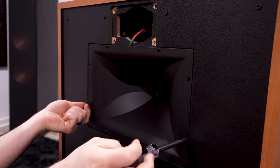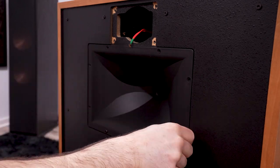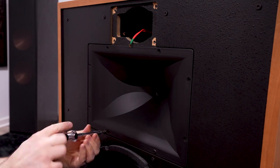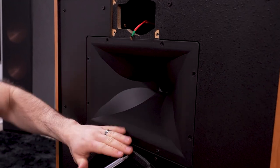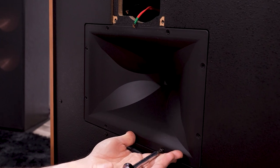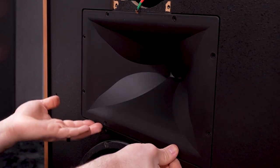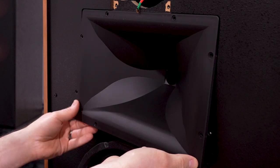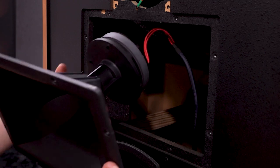Another thing I always mention on these drive components: you're going to want to save a bottom screw for last, especially if they've been removed before and don't have that paint seal. The weight of the driver will tend to make the unit tilt back, so once I get to that last screw I'm just going to keep my hand on the horn as I unscrew, because it is already shifting and wanting to pull out. I'll let it drop just a bit — enough to get a grasp on the bottom side — and then pull straight forward.